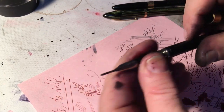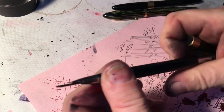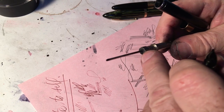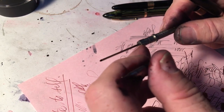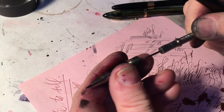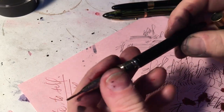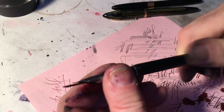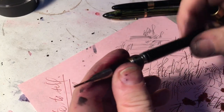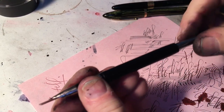There we go. It was in the wrong way. You have to carefully take this out without bending all of this stuff, which of course is what you end up doing. You end up bending all of this, and then getting them back straight is a bitch. This is one of Schaefer, like the Parker Vacuumatic, I think Schaefer did not expect ever to have to repair these pens. They would just send you a whole new one of these things. They didn't expect you to take them apart and fix them. They just send you an entire new assembly.